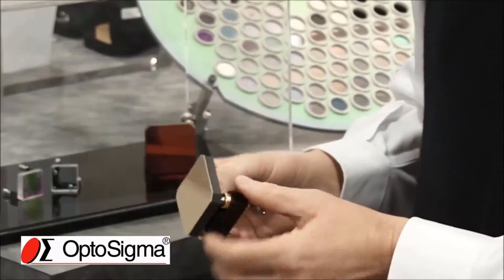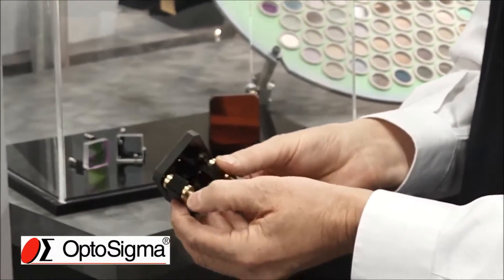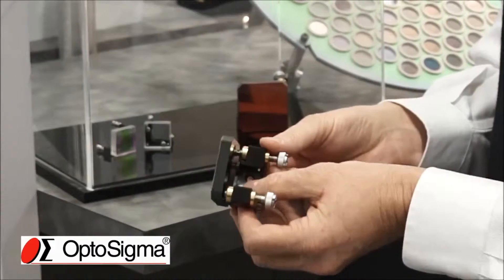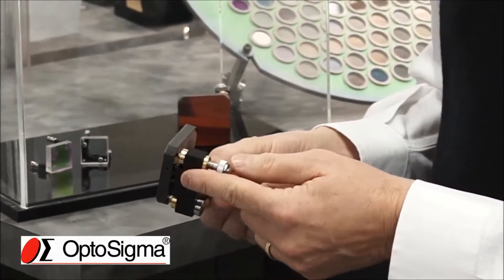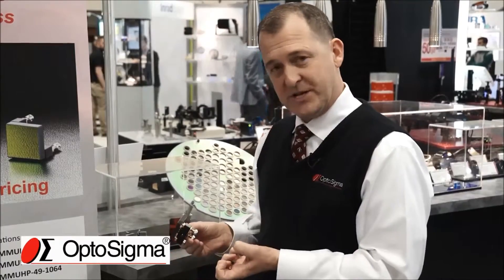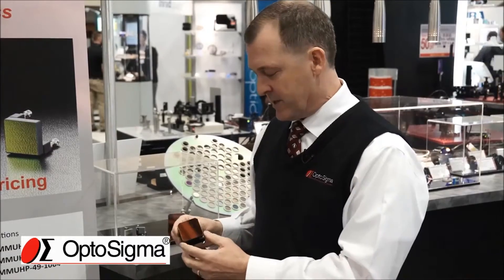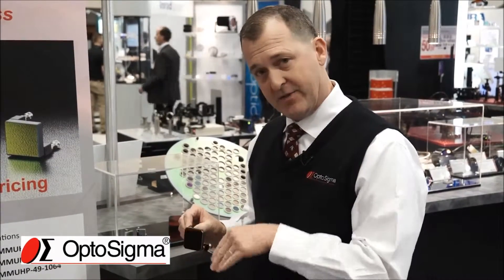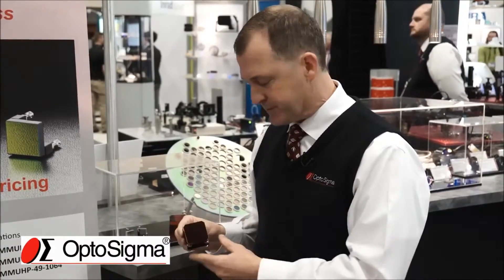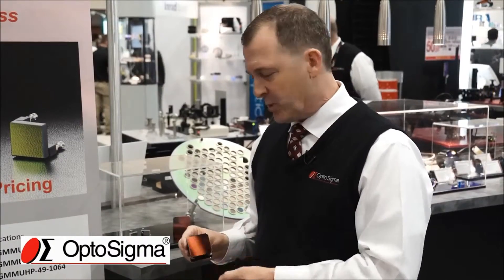What we're doing is we have a piece of fused silica or ceramic mounted directly to the back of an aluminum mount — similar to a kinematic. We machine the optic to accept the spring and pull the tension back onto the mount itself. The advantages are twofold: full aperture, so you can come right to the edge and get these close together when you use them in tandem or in sequence.